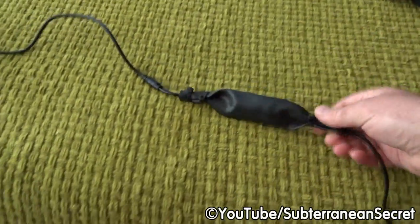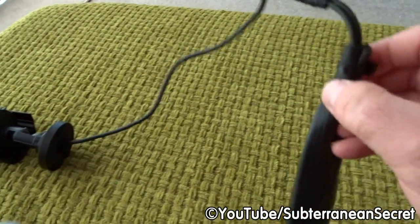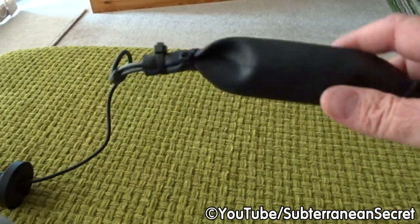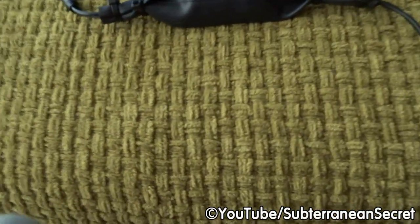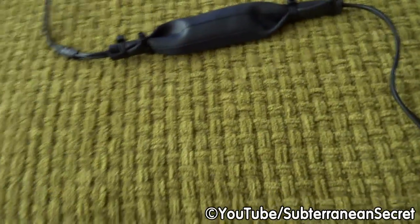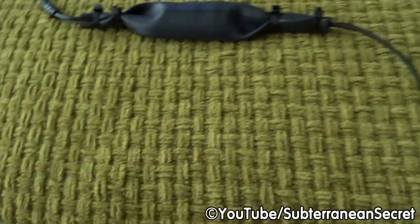Once you pin this to the wall or the fence, I would always pin it horizontally, not vertically, because obviously if water started dripping here, it might eventually make its way in. But horizontally, that should provide a good seal. I've tried this and I've had no problems. And just bear in mind, never do this on a product which is run on the mains. This is low voltage. Very low voltage. It won't cause any problems if any water gets in. It'll probably just trip the thing out.